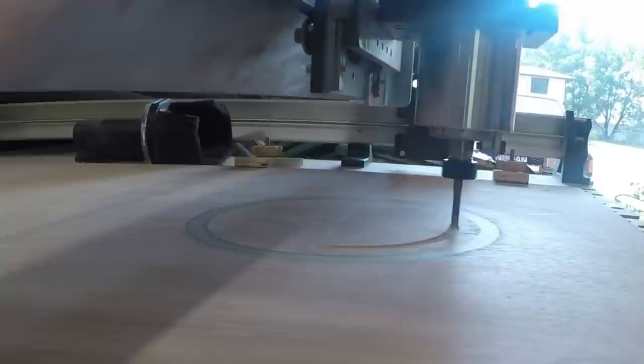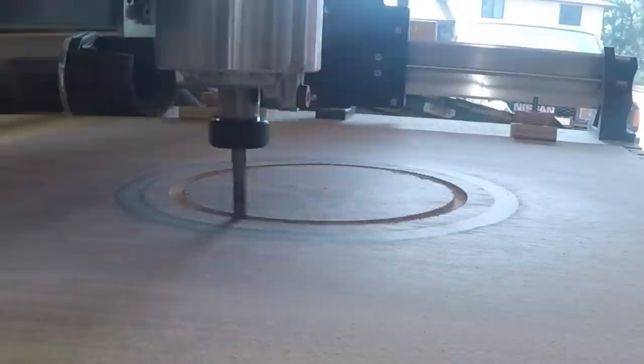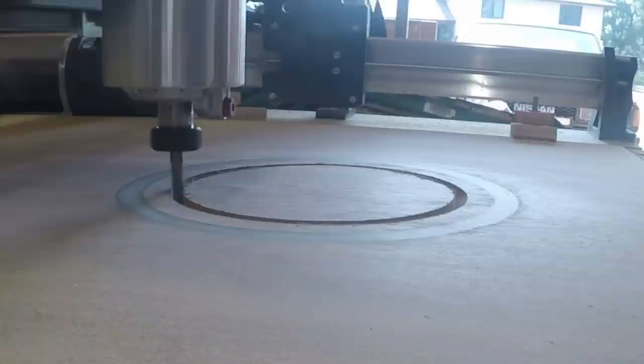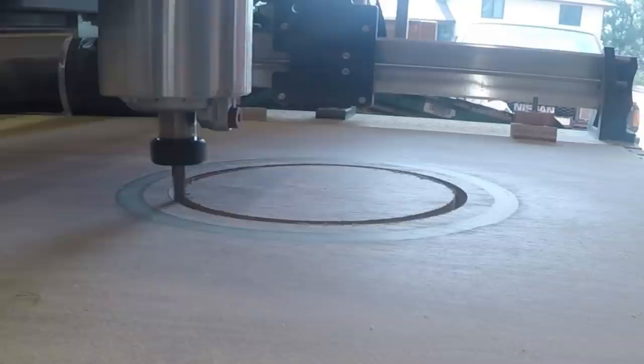Back on the Long Mill now — this is simply cutting out the six-inch hole for the bags to go in. Since I had a center point marked for the bigger LED circle, it was easy to put the board back on the CNC and line up with that center point as my zero-zero on the tool path. Since it's a circle, even if the board is slightly crooked the center position is all that matters.